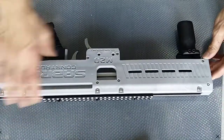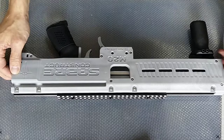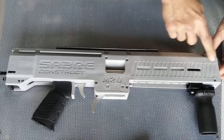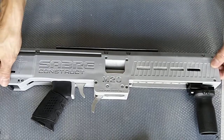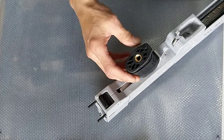This is actually how we remove the M20 shell. If you look at the M20, there are actually screws on top, and in this case the nuts are actually on this side and the screws are actually on this side. So we need to remove all of these and the nuts themselves will come off. But before that, we actually have to take out the pistol grip first.